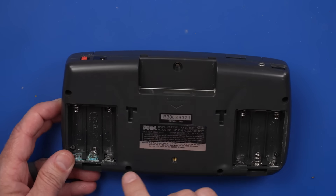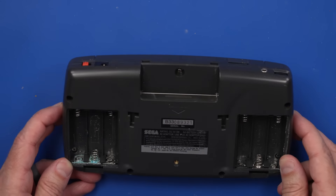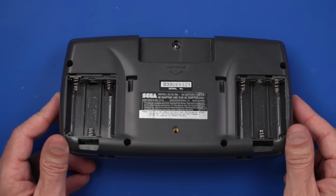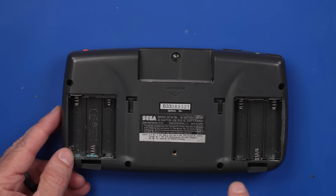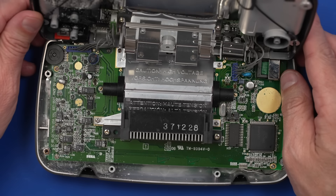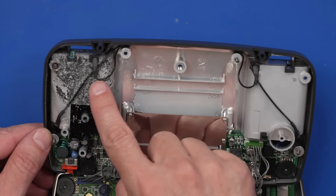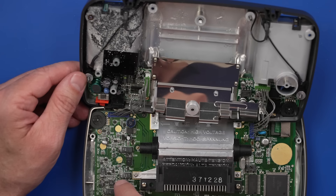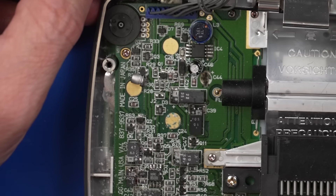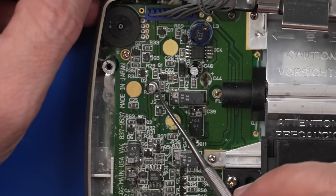Let's move on to the next black one and see what it needs. This is the one that's definitely going to need these battery contacts replaced — I might be able to get away with cleaning them, so I might try that first. Let's get the rest of it apart and have a look at the motherboard. Look at all that corrosion — holy cow! We've got all sorts of corrosion all down here, and we even have a capacitor that's like popped off the board.